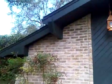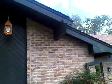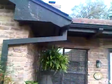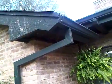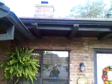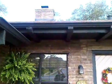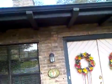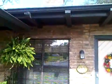Come up here, same thing with those beams. Wrap and cap the beams, fascia overlay all the way around, wrap and cap that beam. Got some rot on this fascia corner here. And on these 4x posts, their facade, basically they just butt up to the house, probably screwed right up into the soffit, kind of toe-nailed up into there. So all of those probably replace what we have to replace.